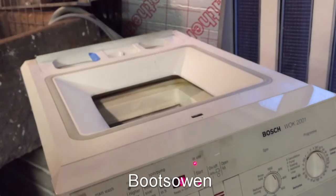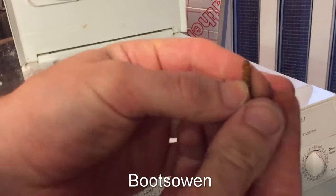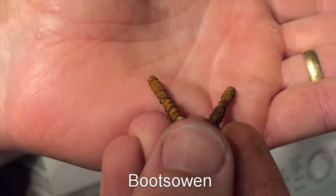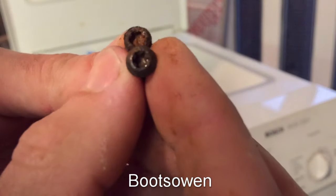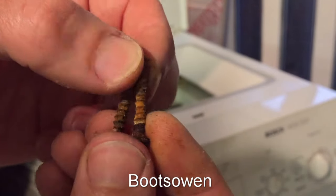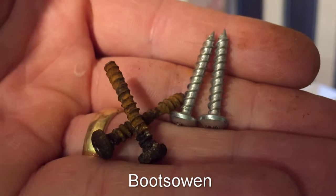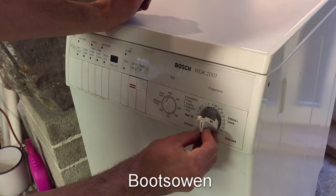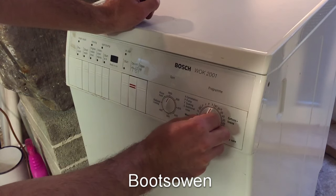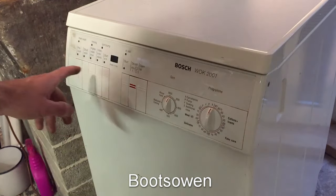The lid just has these legs — there's a hinge that pops in, plastic, one on each side — and they just locate in slots on the back. The screws that were in it before look like this now, and I don't want to put them back in, so I'm going to get another set. They were Torx, and the heads are pretty gone on them, but they came out okay. I'll get something better. A couple of one inch zinc plated screws should do it. I also realised that this had fallen inwards somehow, so I've just snapped it forwards with large pliers and yeah, that just snaps in now. It's got a bit of a scrape on it, but that's not a big deal for me.